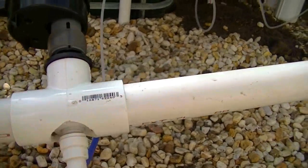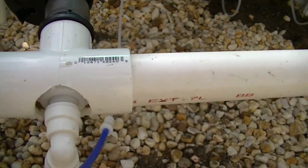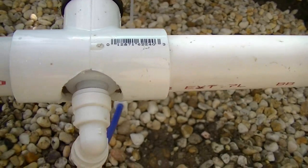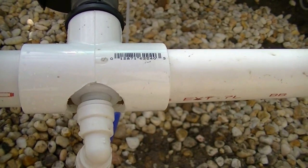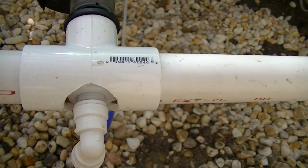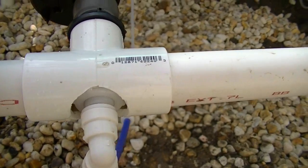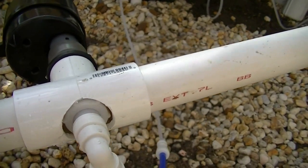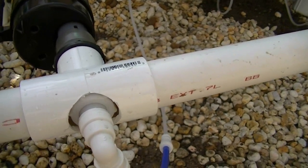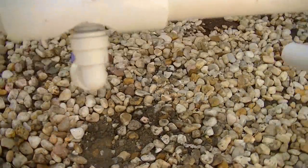The water dripping from the bottom here is coming from the RO system. The RO tank is not pressurized yet, so there isn't enough flow to push the water up through the flow nipple. I solved that problem of the tube protruding from the bottom, which was causing the entire unit to tip, by utilizing this 90-degree 3/8" John Guest fitting. The gray toilet supply line, hidden now by the John Guest fitting, fits perfectly in the 3/8" connector.